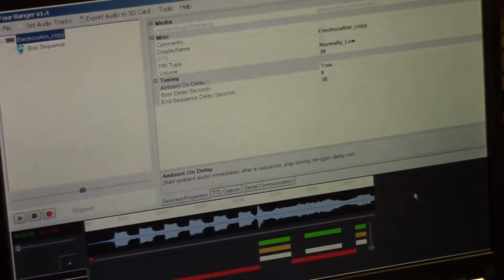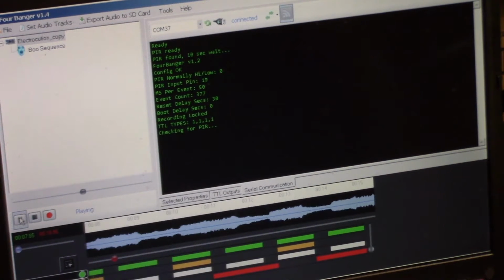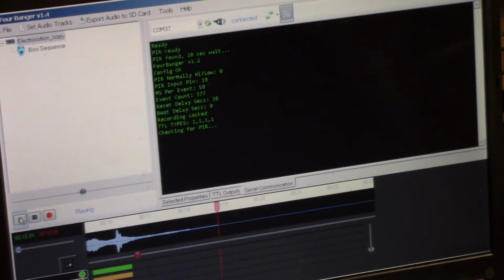So when the power isn't actually connected to the relays, I think is when it works. So there is an electrical issue here. Let's try again. Yeah, there's some kind of feedback that's causing this thing to freak out. I can run it as long as I don't have the AC running through the relays. This works. But that does me absolutely no good. So I don't know why this thing is causing a reset, and my wiring is right.